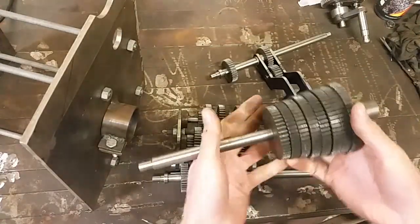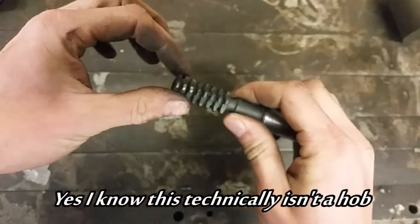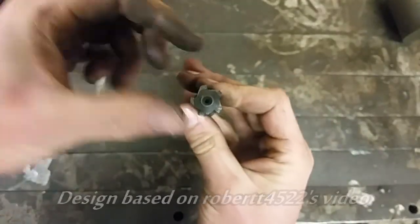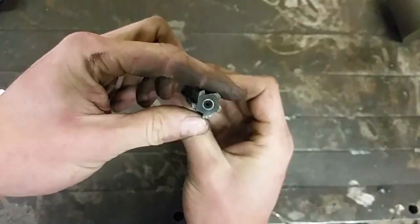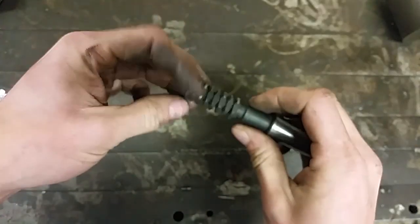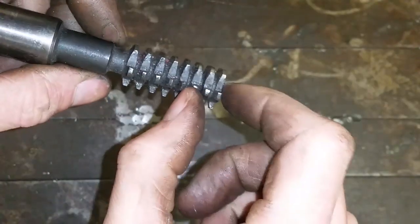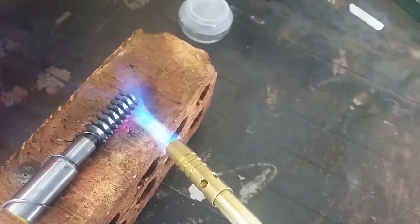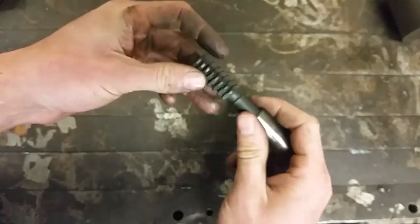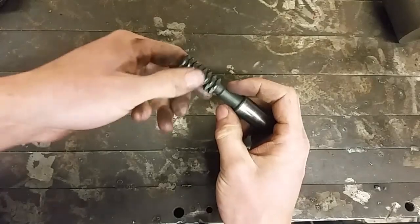From here there's another selector that picks up different gears on the output. I've tried a number of gear cutting methods. Started off with a hob — this design was from someone on YouTube, I'll post a link if I can remember. This is O1 tool steel, one of my first dividing projects and first attempt at gear cutting. You can see it got overheated and the edges rolled over. I was only able to heat treat the first three and a half teeth. It's really slow and you've got to be very careful not to overheat it. A proper helical hob will be a lot better.